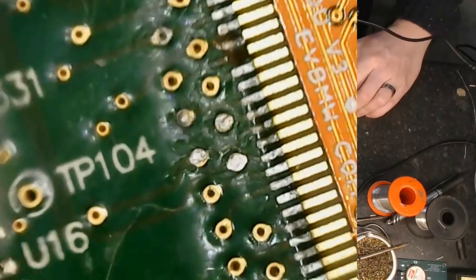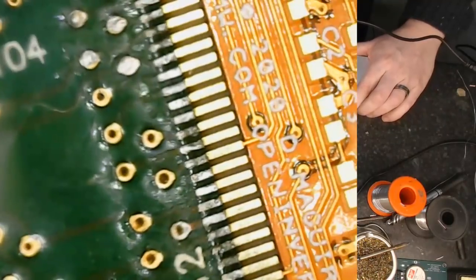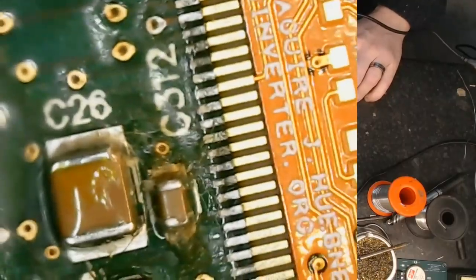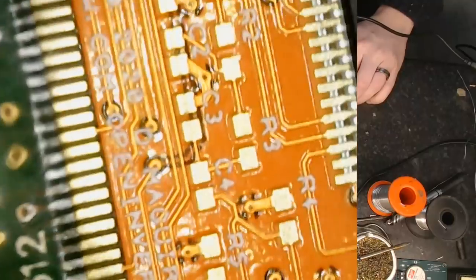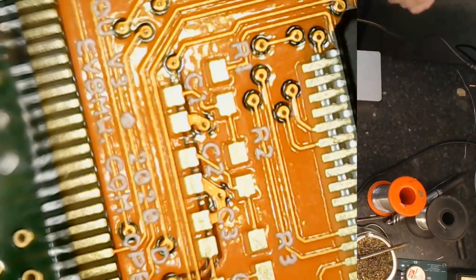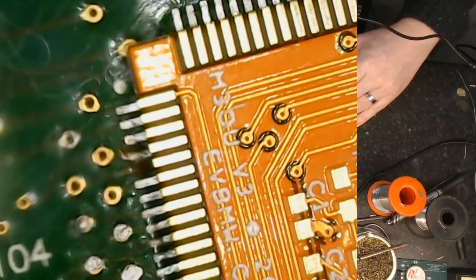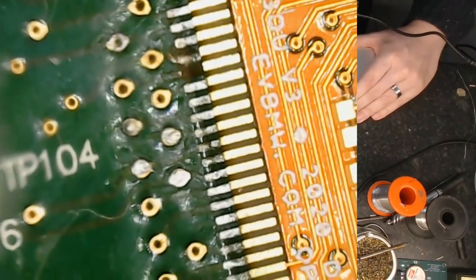I'm just super excited because I think we have a solution now for this Model 3 system. Both the front and the rear drive unit inverters will be able to fit with the same board. So once we verify that the board will physically fit, there's a few electrical changes I'm going to make on the board. And then I'm going to be ordering another batch of these from PCBWay, hopefully fully assembled for us, so we won't have to be doing any SMD assembly on here.